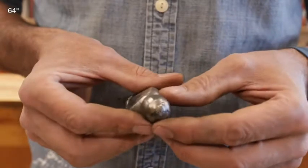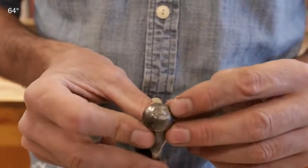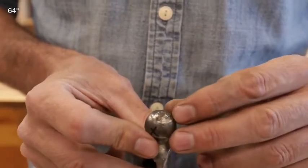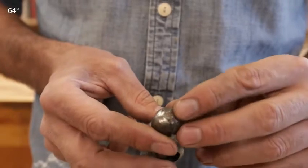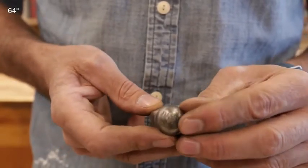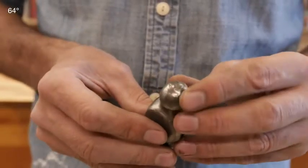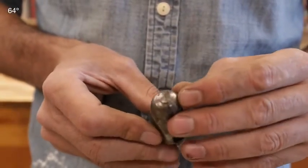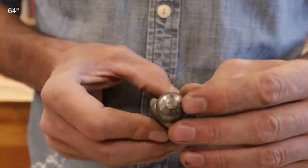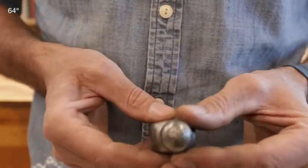Now on the back side, on the ball side, we can see we've got a lot of scratching and some rough areas from pounding against something sharp. Let's dress that and clean it up — we don't want that, because you want to be able to use a ball-peen hammer to work with sheet metal and to round things, and if you have a striking face that's all chewed up it's going to transfer into your work. So we can put this on the vise and I think we can clean this up really nicely.